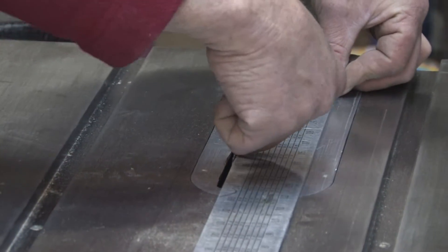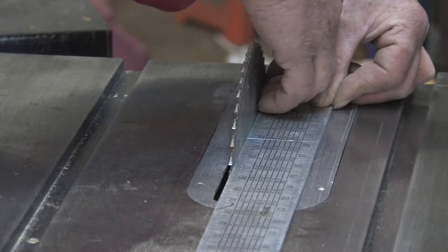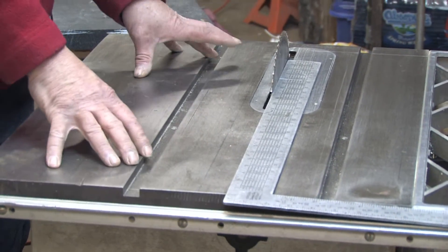Just checking that, you want to make sure you have the same clearance — actually no clearance — at both the front of the blade and the back of the blade. If this is square, you know your blade is calibrated to the rest of the saw, and using the other adjustments is easy.